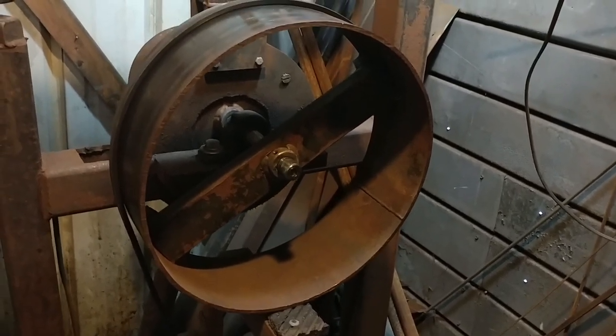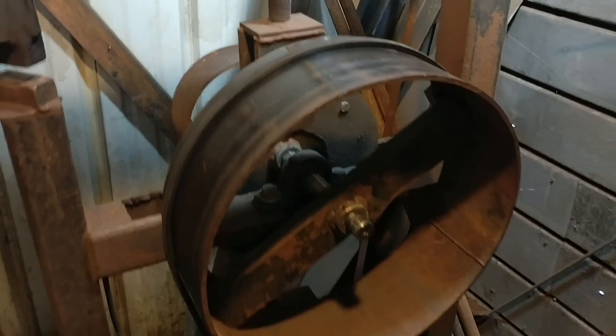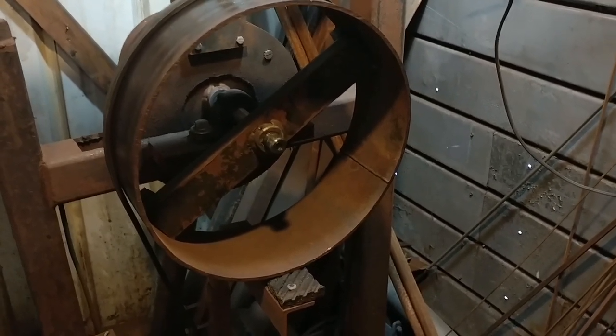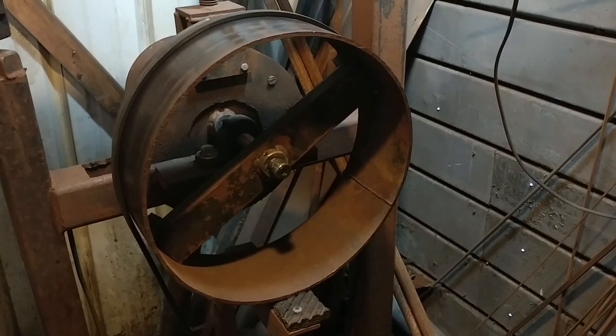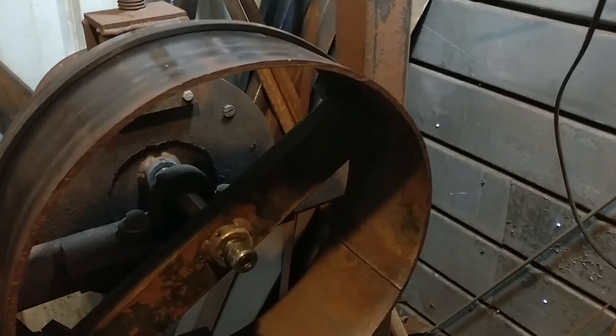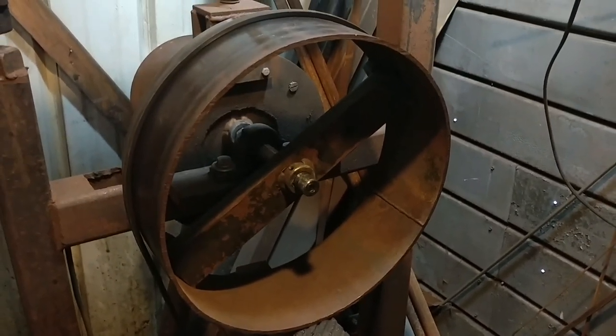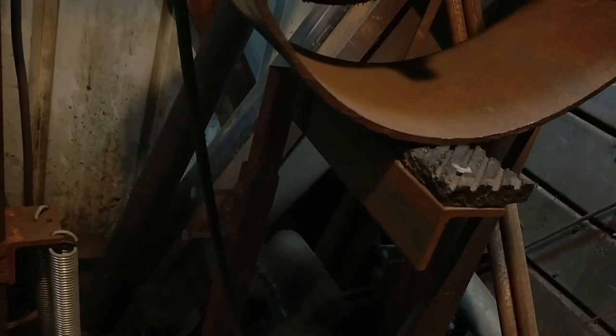This here is just a simple clevis that I made. I couldn't find any factory ones I liked that I could trust, as they were cast iron, so I went ahead and did something different. This pulley is self-made — it's out of a large diameter steel well casing pipe I bought at my local scrap yard. They cut me off a sliver like you see here, and it makes a very nice slip belt pulley. The only thing I had to do myself was buy a piece of one inch by three inch stock, weld it in the center of it. To get it centered, you just make sure the shaft is going through the center of the bar at equal distances to both sides — the thing slips right in, welds right up, and everything's centered.